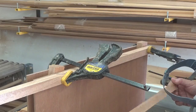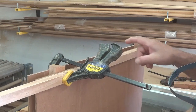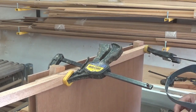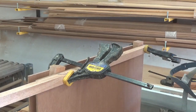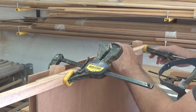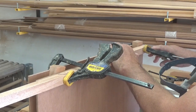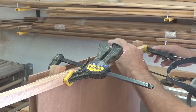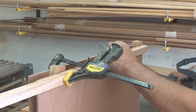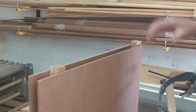I think on these top rails, I'm going to notch it in, dado it in, so that it actually fits over top of the plywood. Nobody wants to see the top of that plywood, not to mention the end grain is susceptible to sucking up moisture, so I'm going to take these off and cut a six-millimeter notch. It's going to be very thin — maybe an eighth of an inch thick — but overlapping the end of the plywood.